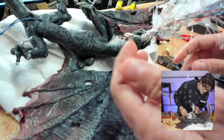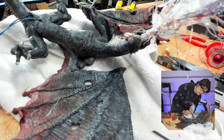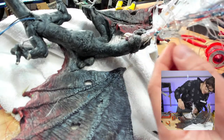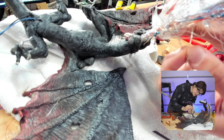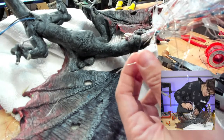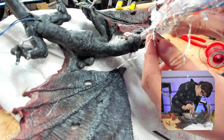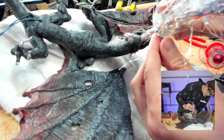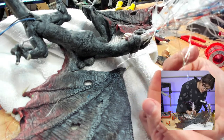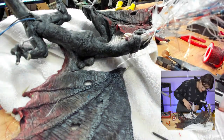Yes, normally I would neatly tap everything as we go. But in this case I'd rather almost run a jumper wire, like we did at this point right here, the little red jumper, which I should have painted, but he's so tiny, he's barely visible. It's the big ugly black insulation. I forgot to look into white insulation, see if they just have white that we can use. All right, so what is the closest one? This one right here. This one is another one of those big old LED leads. So let's see if I can bend this guy over here and maybe he can bend back. Oh no, I'll probably need a tiny jumper just to keep things bending in this direction, not in that direction. So let me prep a jumper.